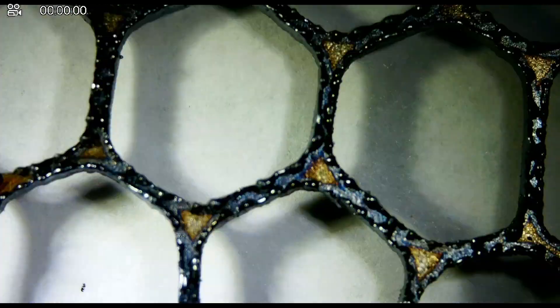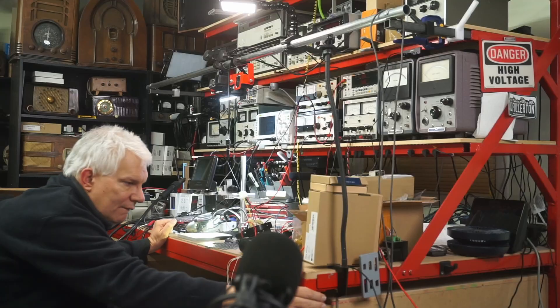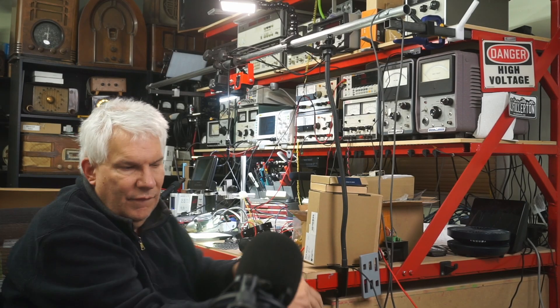So in summary, if I wanted to get really nice cuts I'd have to slow the speed down. And when I slow the speed down, the laser is so powerful I decided to cut back on the laser power as well, because at 1500 watts I would be blasting through the material really quickly and the laser energy would be hitting the bottom of my tray. So I turned the power down to 600 watts.